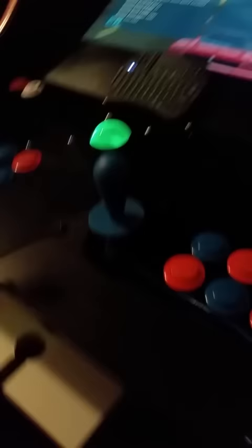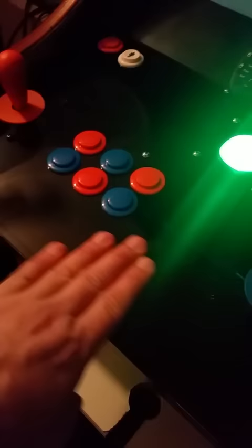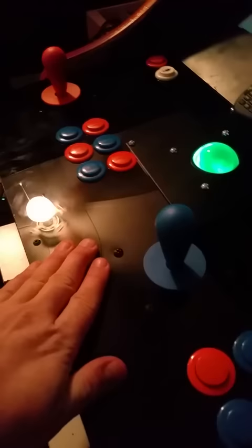Thanks for taking the time to check this out. I put a lot of work into it. I just finished the top this weekend — it's a really cheap way to get a nice shiny glossy look to the board. It's still a piece of particle board shelf underneath, but I drilled out a piece of Plexiglass where all the buttons are, mounted the trackball, and painted the bottom side of the Plexiglass flat black. So the top isn't actually painted — it's nice and smooth like Plexiglass — but because of the flat black on the bottom, it looks nice and shiny. It also picks up fingerprints and cat prints very well, because Miss Delilah likes to climb up on the arcade unit. Alright, that's it — thanks for watching. You'll see much more of this if you're friends with me on Facebook.